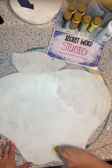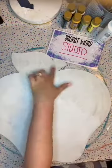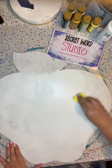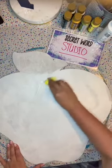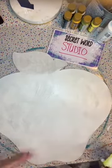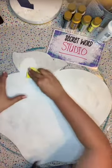All right, so we're pretty good. I'm gonna finish my second coat over here. It's already dry, and I'm just kind of buffing this on. I'm not worried about massive brush strokes. If you want to avoid brush strokes or streakiness, put on your first coat and then go back in with a light second coat with a 2-inch base coat brush.